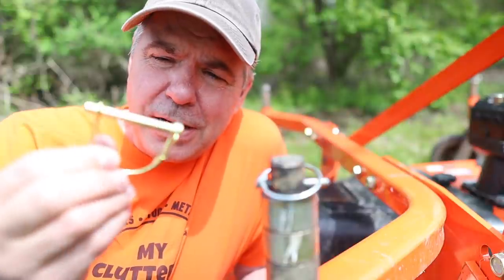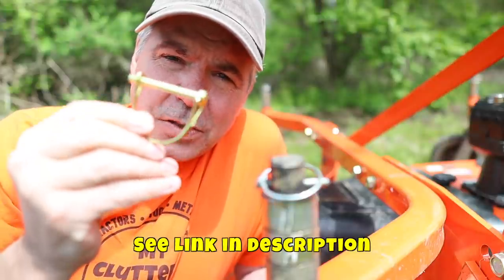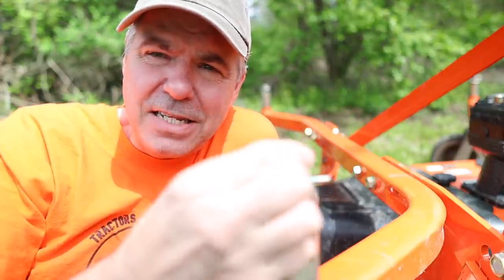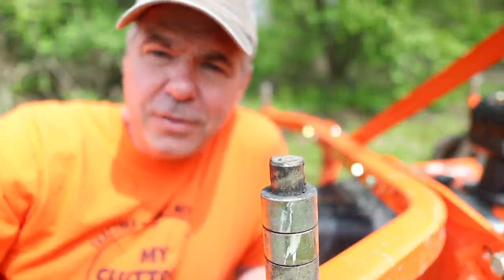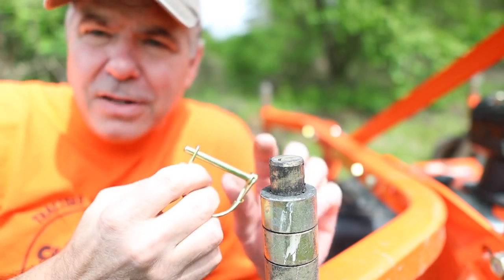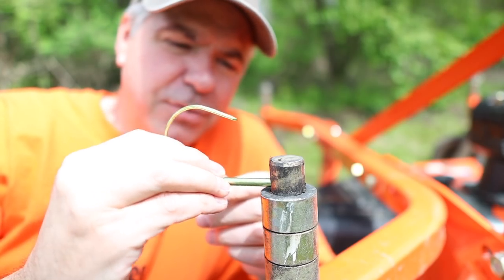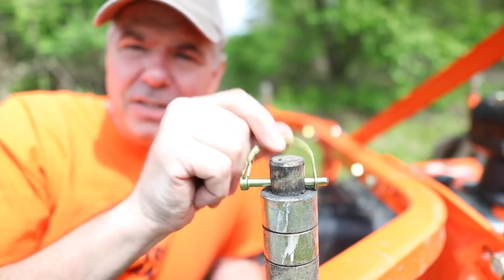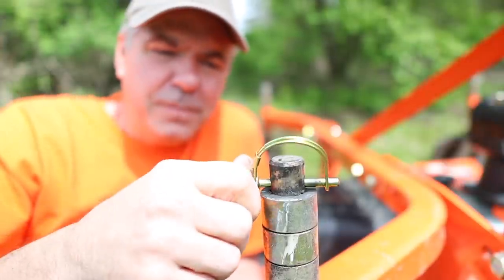Here it is. It's probably still categorized as a linchpin because it's used to hold things onto an axle. But what's really neat about this pin is that it cannot be pulled off very easily — not as easily as these spring clip types. You have to open it like this, or you pull this spring off. Then you slide this through and put the pin on like so. That should hold just great, and it would really take a lot to pull this off.